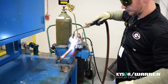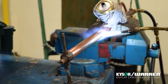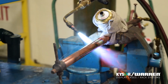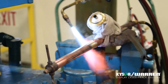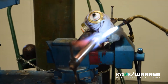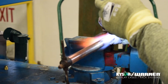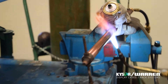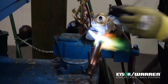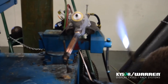Always start by heating the inner tube about an inch away from the end of the fitting. With the entire heating process, you want to stay within the heating zone, which is about 1 inch from the joint. Keep the torch in motion while you are heating and make sure to work the flame around both sides of the tube. Continue to do this until you reach brazing temperature. You know you have reached brazing temperature when you have produced a low red glow on the piping. Once you see the red glow on the inner pipe, make one final pass of the flame at the base of the joint to expel any entrapped gas and ensure the filler rod material will flow. Now proceed to the outer tube joint and heat the fitting, moving the flame back and forth to maintain uniform heat. As you heat around the joint with the torch, be sure to follow behind or chase the flame with your filler material.